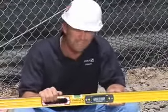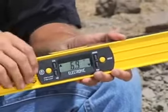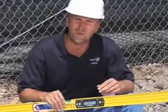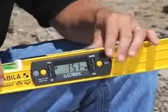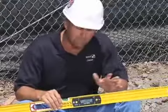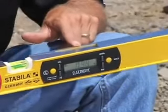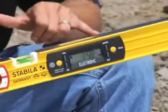With this module, we have what we call five languages — five different types of measurements that contractors use. Number one is degrees. If I hit the mode button, I switch languages. The next mode is percentage of grade, used a lot by concrete contractors and West Coast plumbers and mechanical contractors. The next mode is millimeters per meter, used mostly in Europe but also on U.S. and Canadian government jobs switching to metric. The next mode is inches per foot, which tells you exactly how much fall you have over a given footage. In decimal form it's great for math, and the fifth mode is inches per foot in fractional form — what you read on a tape measure.